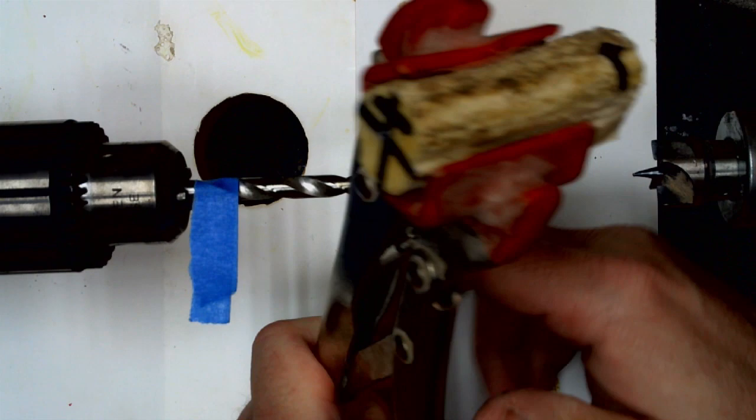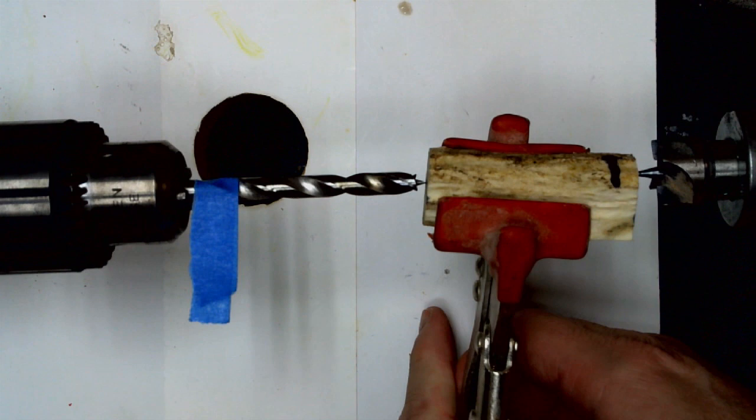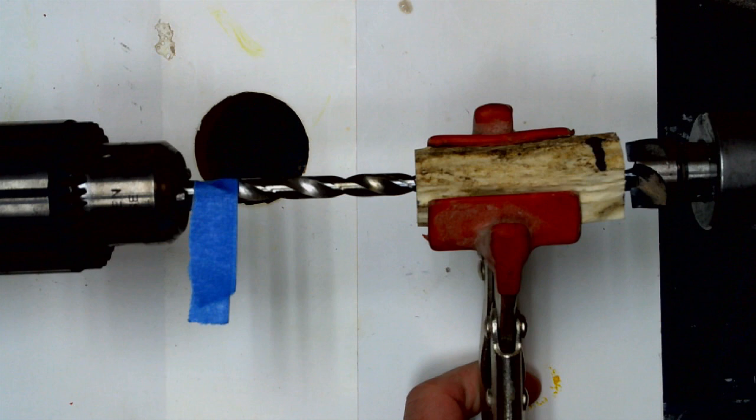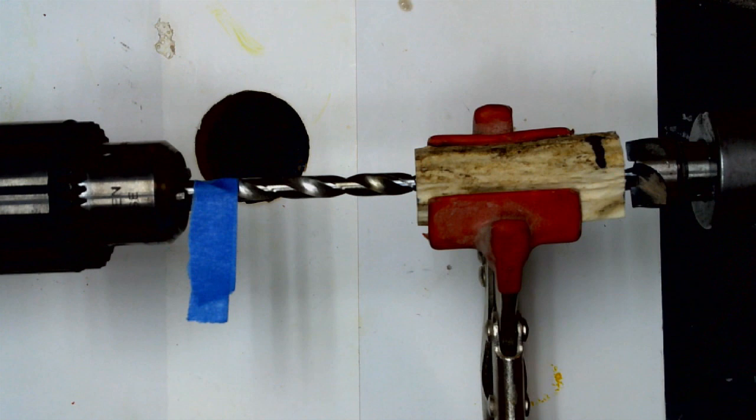And what I did was I put this little blue part over on this side so I know where I'm going to be. And I know I'm going to find it. So now all I got to do is take this blank, find it on my drill press there, my dead center now just caught in, and so now I'm going to just take this out, so I'm going to let my drill start up. And what's important is I used a brad point bit.